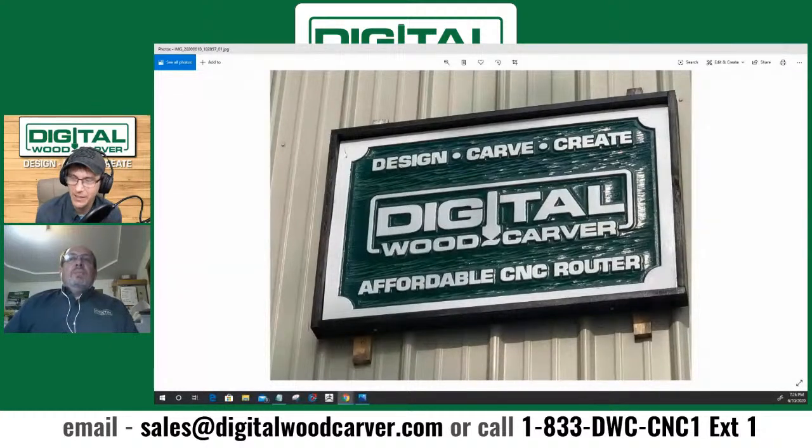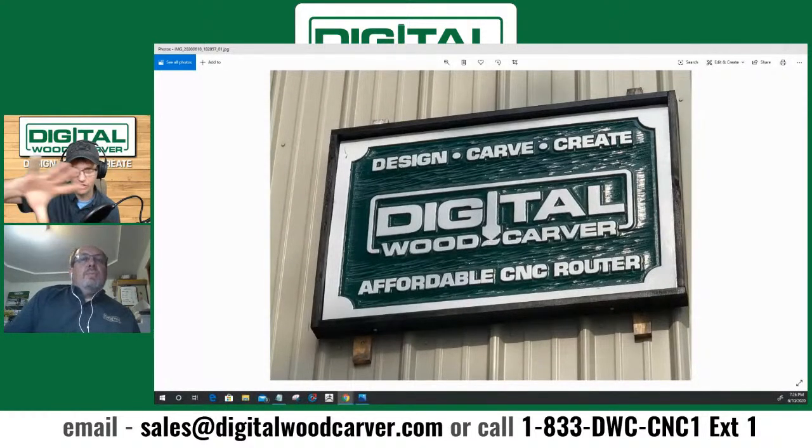Typically, ladies and gentlemen, if you ever see signs outside of subdivisions with the subdivision name, or building signs like what Burl's got here on his building, this is a UHD ultra high density sign foam. Now, it's expensive. It comes in different thicknesses. But it doesn't warp, twist, expand, or contract. It handles all the elements well. It paints beautifully, and it carves like butter. It's just amazing. Now, it's messy if you don't have good dust collection, but it's a great alternative